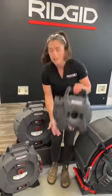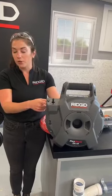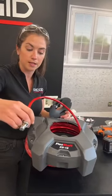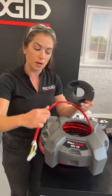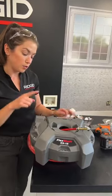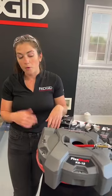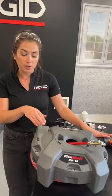Our newest one is the K9-12, a great entry-level product into the flex shaft line. It uses the same quarter-inch cable as the 102 — 30 feet. It does have an internal mechanical clutch to help protect your cable, but it's basically bare cable wound in the housing. Our larger machines have inner rotating drums that make it easy to push the cable out and pull it back in; this one is a bit more difficult since it's just wound cable in the drum. You take the end of your cable out — it has an inch and a quarter chain — and attach your cordless drill. Because this has a built-in clutch, you don't need to worry about setting the clutch on your drill like you do with the 102 and 204. The input shaft here will spin your cable.